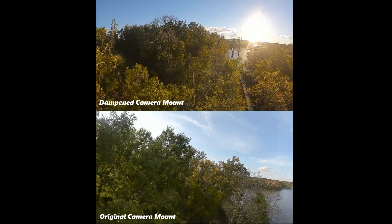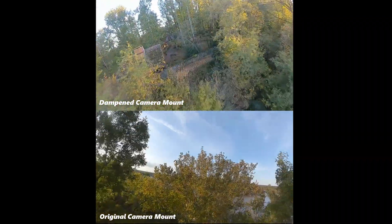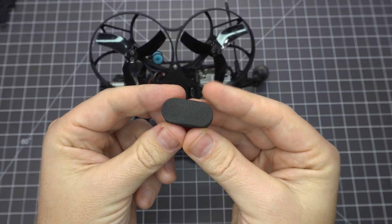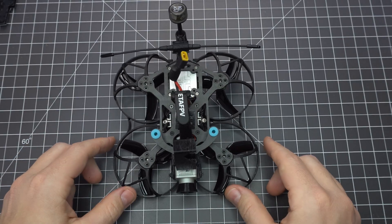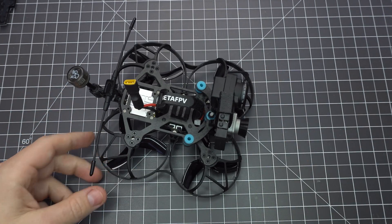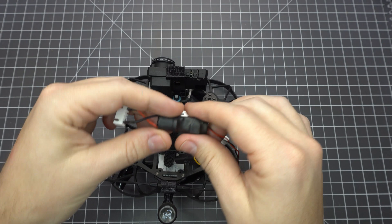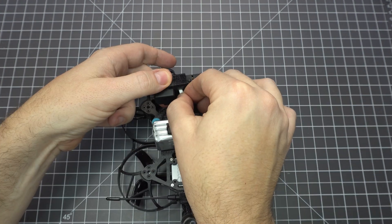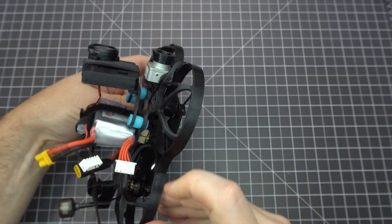Look for the link to all the 3D printed parts in the description, and a big shout out to the MakerBoys for all the work they put into designing these components. You'll also need to raise the motors off the ground as the screws will rub — I used a spare landing skid but you can use whatever you've got. To avoid covering the USB I had to center it, but after mounting the GoPro and battery it doesn't rock. I like to use an external BEC to power the naked GoPro through the balance lead, strapped to the battery so everything is convenient to plug in. Make sure the battery doesn't make contact with the GoPro mount as it'll send vibrations to the camera.